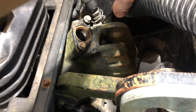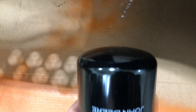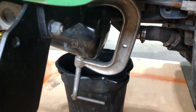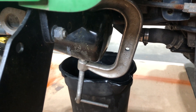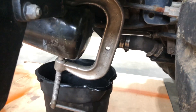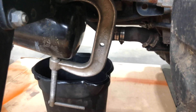That's the main tip to minimize fluid loss when doing this. The other big tip is that these filters are huge — probably too large for a standard oil filter wrench. You can try to take it off by hand with a leather pair of gloves, and you might be able to get it that way. But if it's really on there — and they usually are, since you typically don't change these until every 400 hours or when hydraulics become slow — you can use a small clamp, tightening it just enough to collapse the filter slightly so it grips.